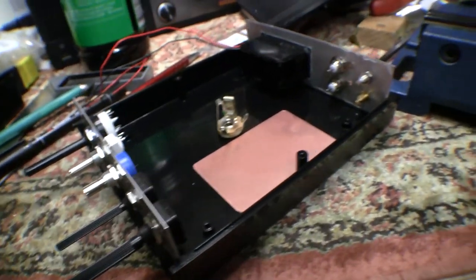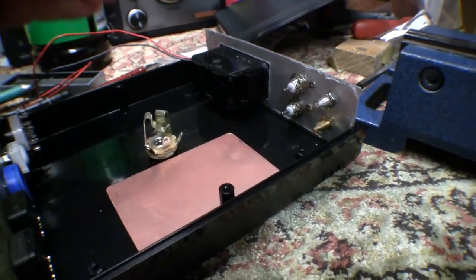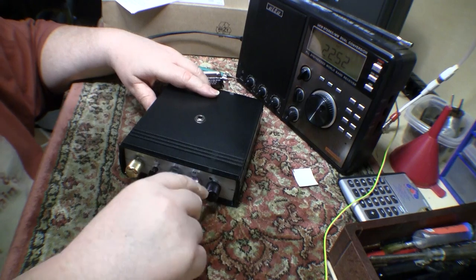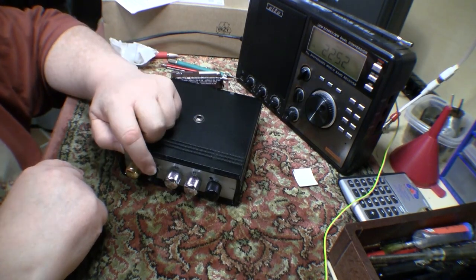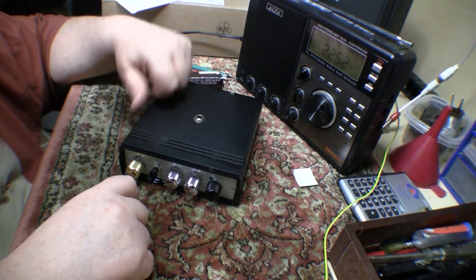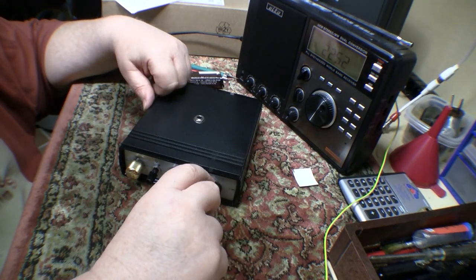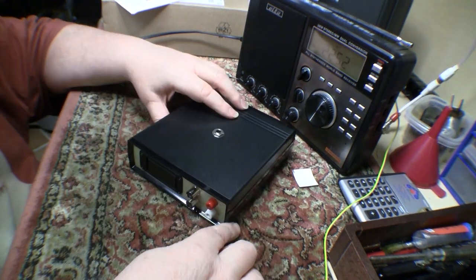So this is what it looks like — it's sort of upside down, so everything will be fixed to the top and then you just screw on the bottom half of the case. To get at it and troubleshoot it, you just take the bottom off and everything is there. I went looking in my junk box to find some knobs — it's a little bit of a collection but the colors didn't freak me out. What's freaking me out is that one of these pots is smaller than the other ones, so I've got to go change that. The layout is: Q-multiplier, coarse tune, fine tune, output, and on/off — sorry — off, wire, and loop.